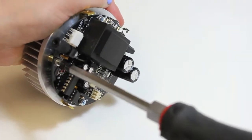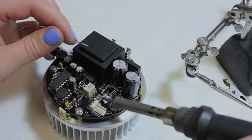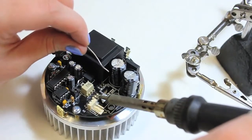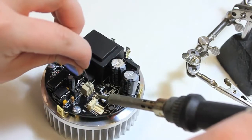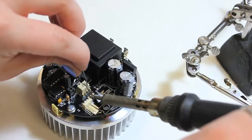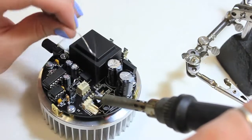Also, don't forget to tighten the nylon screws that hold in the IGBTs. You'll be soldering the leads from the top of the board. It's also important to note that if you put a lot of stress on your coil in the future, the IGBTs are typically the first to go and you may need to replace them. Leaving the leads long will help make that process easier.